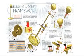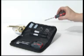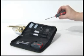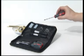Look carefully at the parts list and the exploded diagram before starting. Part numbers in the list are shown on the exploded diagram and all step-by-step assembly diagrams. Make sure you have the correct tools to hand. You'll need a 1.5mm, 2mm and 2.5mm Allen keys, also called hex wrenches, and a small Phillips-type cross-head screwdriver. Do not use a posi-drive screwdriver.